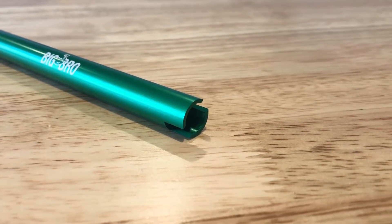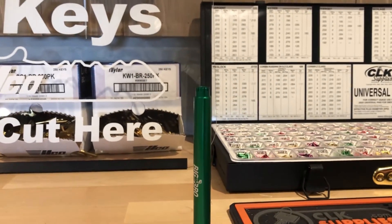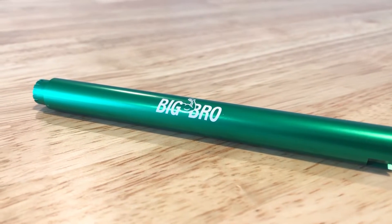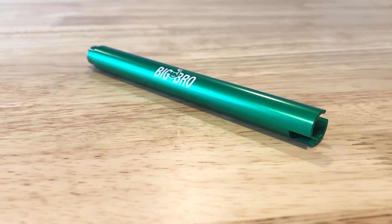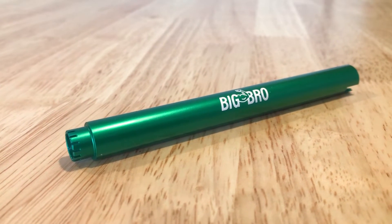That's why I want to present to you the Mullet's hero: Big Bro. Big Bro has everything the Mullet wants to become. Not only is it a plug follower and a cylinder cap removal tool, but it's also a master pin follower — so when you're doing rekeying jobs, you don't have to use a separate follower to check for master pins in the chambers. You should never rekey any used lock without checking for master pins for maximum security. Not only does Big Bro replace three tools, but it makes sure you never leave a master pin behind.